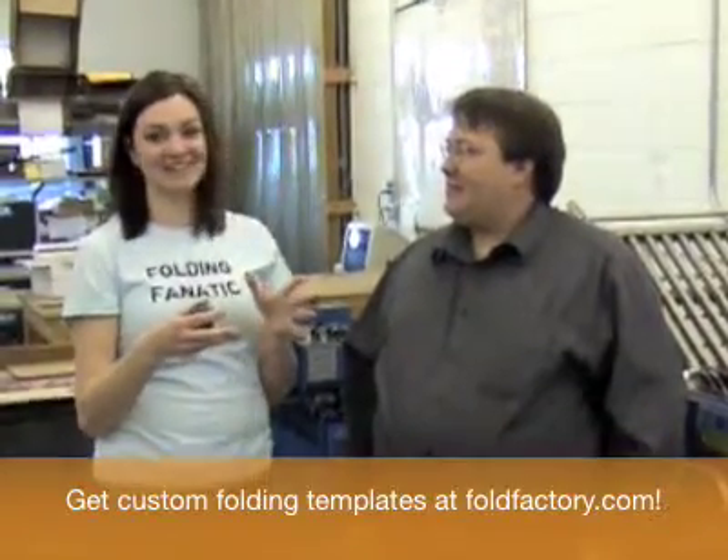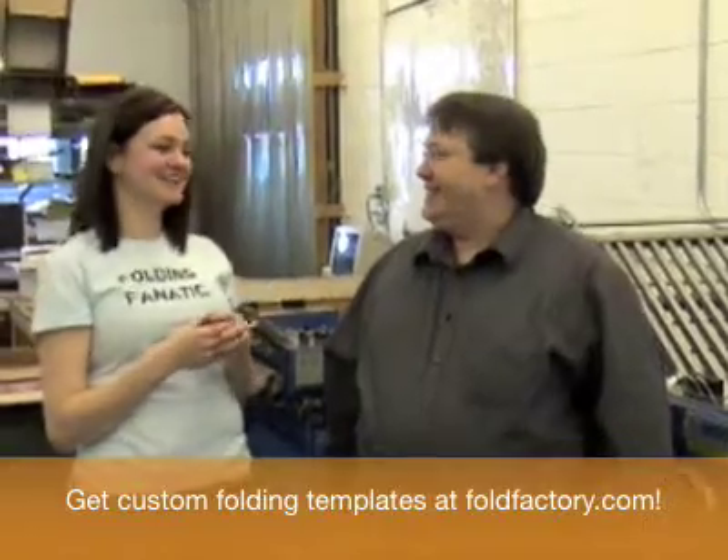How important is digital document setup — the file setup of the art — when it comes to folding? Extremely. Especially when you've got multiple folds and different panel sizes, because if those aren't made correctly it changes between a thicker sheet and a thinner sheet and how much you need to spread those out. If it's not right, your piece is not going to fold right — we have to make it fold and lay flat. Customers come in with their files, we double-check it, send out proofs so they can see exactly how it's going to look. If somebody sent a digital template set up correctly, that really speeds up the process.